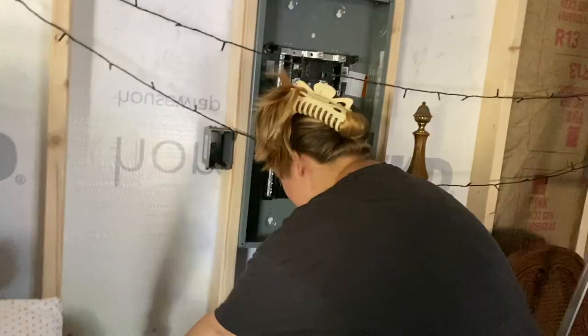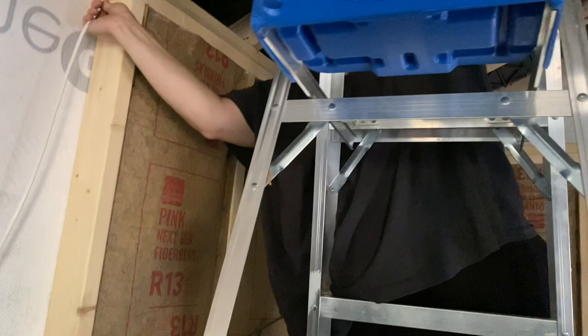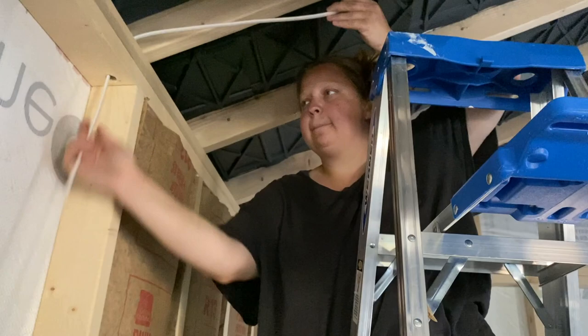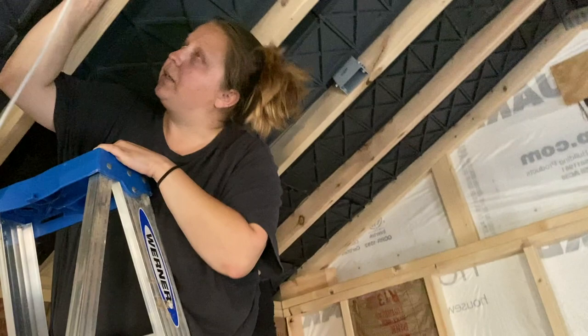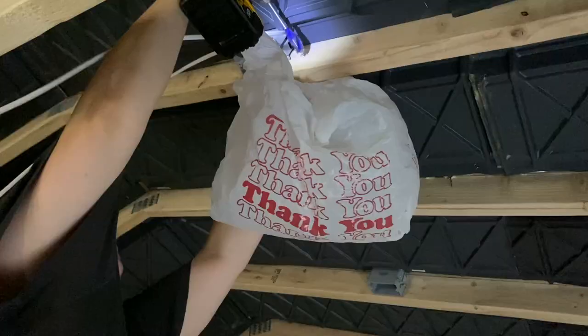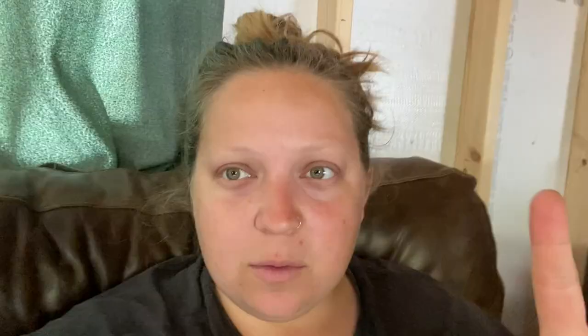Casey already cut the holes. I'm going to be pulling this wire. I'm just using these junction boxes for safety so the connections sit inside, but the lights themselves will sit on the ceiling — you cut a hole in the ceiling and they have a spring lock. The baffles create an airspace underneath the roof. Putting the baffles up would take five seconds if we didn't live in here, but we have to move stuff around every time we want to move the ladder, which is not fun at all.